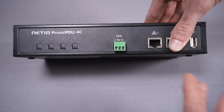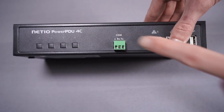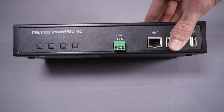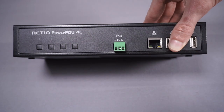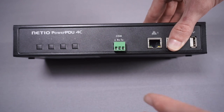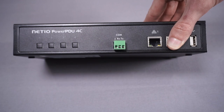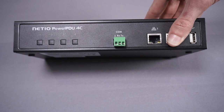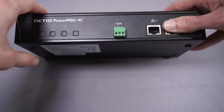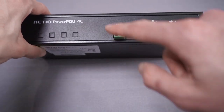The serial port can also almost act as a serial console server. You connect it out to a device and the Net.io will expose that on the network as a Telnet interface — you Telnet to a specific port on the Net.io's IP and it gives you a console on the serial port. There's no authentication, but it could be quite useful if you've got an external device you want to manually control over serial. You probably wouldn't buy this explicitly as a serial console server, but it's a nice feature to have.